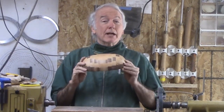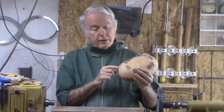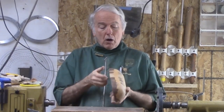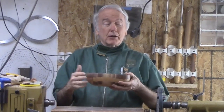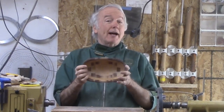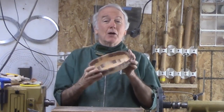This is a segmented piece. Some differences in the segmentation on this piece: each of these rings is of a different height and a different segment count. This allowed me to have a full segment of walnut on each side of the cut, then cut the bowl in half, go together again, and voila — an oval bowl. Very doable with the tools I have right now, and I think it turned out quite nice. So let's turn this segmented oval bowl.